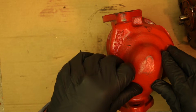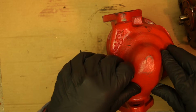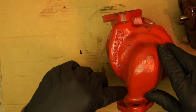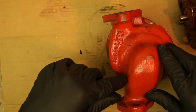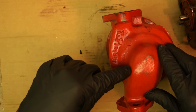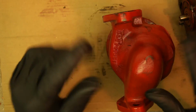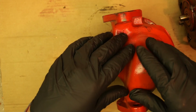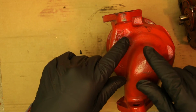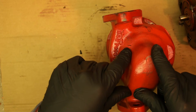Okay. Well, if it's a switch, I don't know how it's going to bring the temperature to 80. Because what's going to happen, this pump is going to keep running, keep running, and the water in the boiler is 180 degrees, so it's hot, a lot of hot water. And when that water gets upstairs, it just gives out heat. Keep doing that, and when the thermostat is satisfied, it's going to open the switch again. When your room temperature gets around 80, the switch is going to open, and that's how your thermostat works.